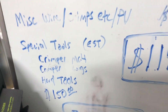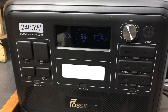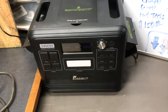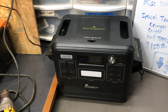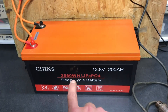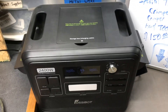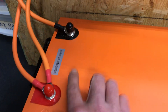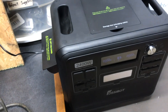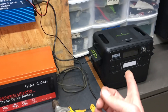You'll need to factor in specialty tools like a crimper or MC4 tool if you don't already have electrician's tools. A comparable pre-packaged solar generator or portable power station is $1,499.99 — it's compact, ready to go, and you don't have to build it. For something in the 1,500–2,000 watt, 2–3 kilowatt capacity range, I'd personally get a pre-made one because the price difference isn't that large, it's portable and compact, and you won't have children touching exposed terminals. You'd need to build some kind of cover to keep an open system safe — the safety advantage clearly goes to the power box.